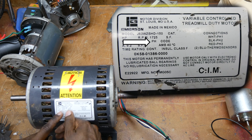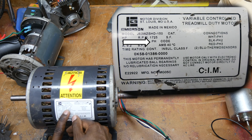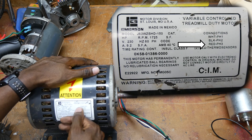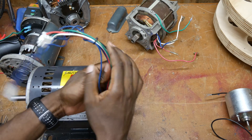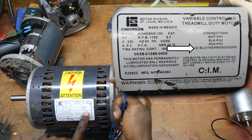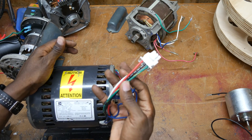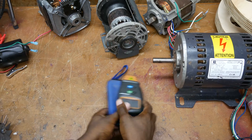There's nothing about phase listed here — where it says phase, there's a blank with no number stamped. Another clue: it says phase one, phase two, and phase three with colors next to them. Looking at the wires coming out of it, I've got two blue wires labeled 'blue thermosensors,' and then the other wires are for the three-phase power supply. So this is a three-phase induction motor.